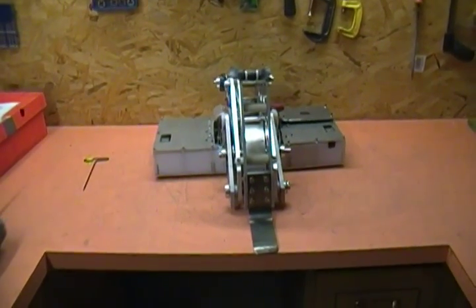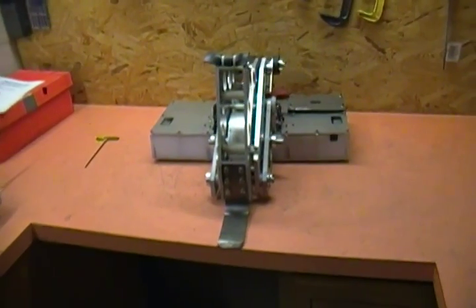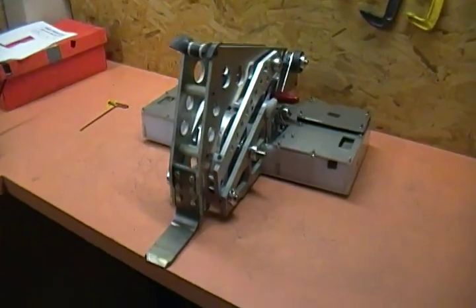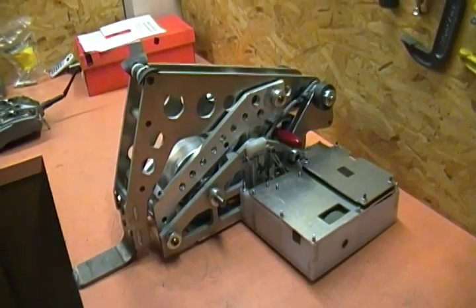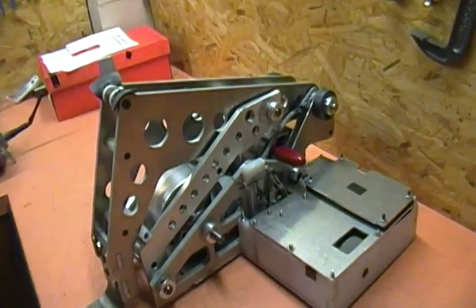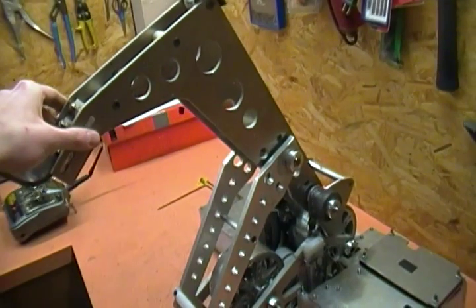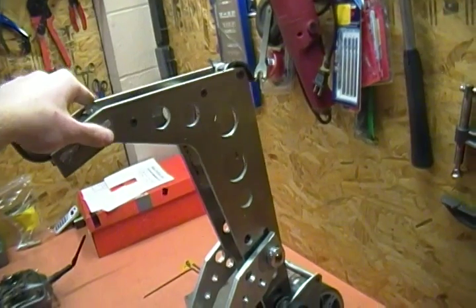This is a walkthrough video of my new 30-pound sportsman robot that will be competing at Motorama 2014 in Harrisburg. It's still a flywheel-powered flipper robot, but instead of having a normal rear-hinged flipper, I have what's called a four-bar mechanism, so the whole arm sweeps up and forward to flip the opponent, and it actually keeps going to make it self-right a little bit better.